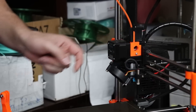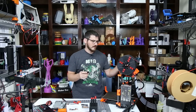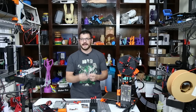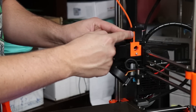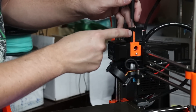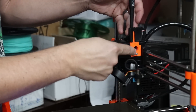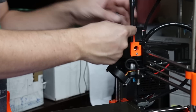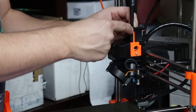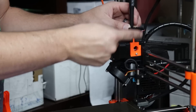The very first thing was someone pointed out in the stream that I was using the wrong piece for the idler, which is now this orange one here. I was using the standard one — this is for the standard MK3S without the MMU2 on it — so I was using the wrong one. The reason why it's wrong is because of this arm right here. When you put a piece of filament in — I'll simulate that with a screwdriver — you're going to watch this top part. It pushes in and this pushes out; that's just the tension on the idler bearing. When it does that, it then goes in between the contacts of the optical sensor, the IR sensor they call it, and that is what says hey, there's filament in here. It doesn't actually trigger on the filament — it triggers on this arm.